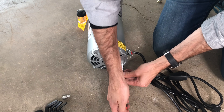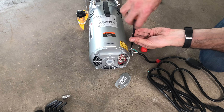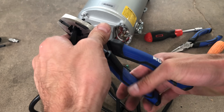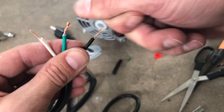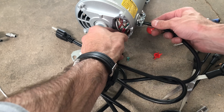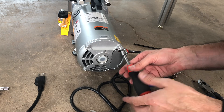This is the vacuum pump that's going to provide the suction pressure for the table. I could have kept the plug-in inline switch and turned it on and off manually, but I'm building this from scratch and I want to make sure it's completely custom and operates the way I want. So I'm going to integrate this control switch into the panel, and that involves rewiring the vacuum pump. Not terribly difficult, and only took a little time, but well worth it.